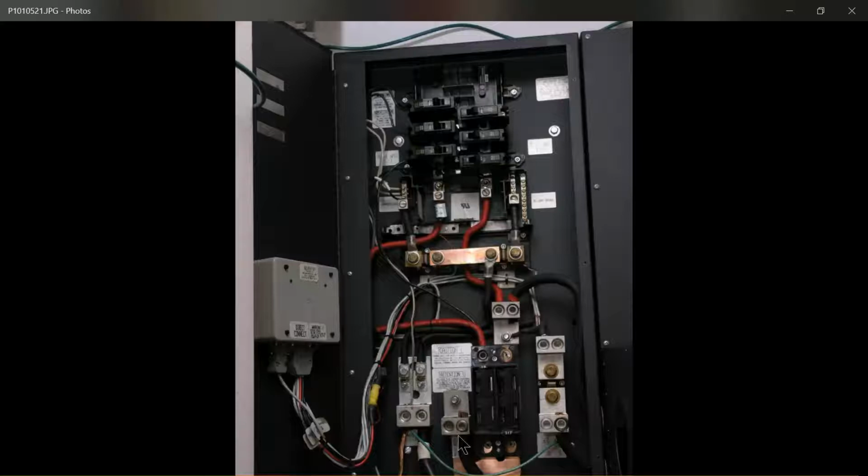The positive, the battery positive, comes in down here, and you can see there's this copper bus bar plate that connects the positive of the battery effectively to the lower part of this safety pole fuse block. It's a 2-pole fuse block. And the left side of that, the battery connects to the PV contactor. A contactor is just a relay that opens and closes based on whether or not the battery is charged, or what the state of charge is.